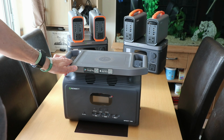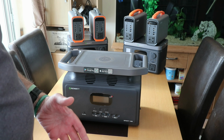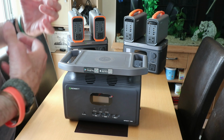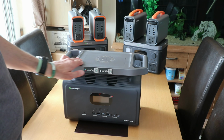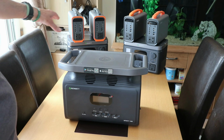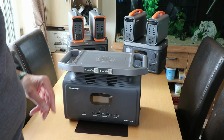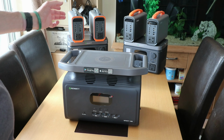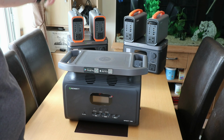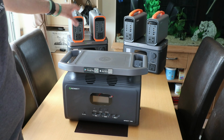So we've never really paid for anything USB. You've got hundreds of USB items, everything which is USB in the house. There must be at least 6 or 7 mobile phones, about the same tablets, flashlights, things like that. For at least 2 years I've never paid for any USBs. And these are about 300 watt hours each, so each day we're charging up at least 600 watt hours off the sun, easy, for charging up tablets and things.